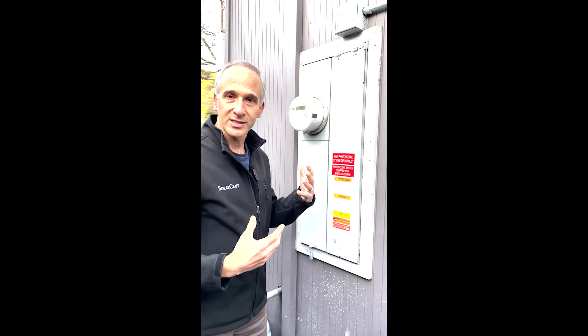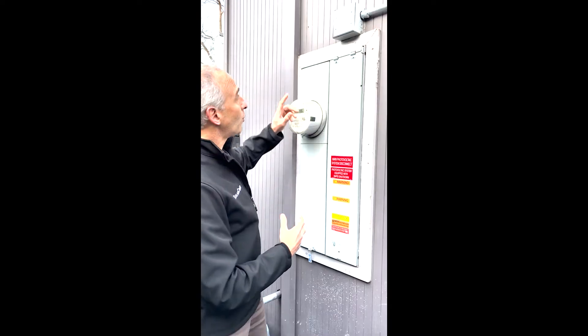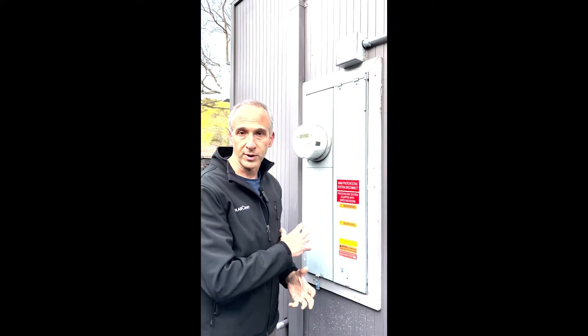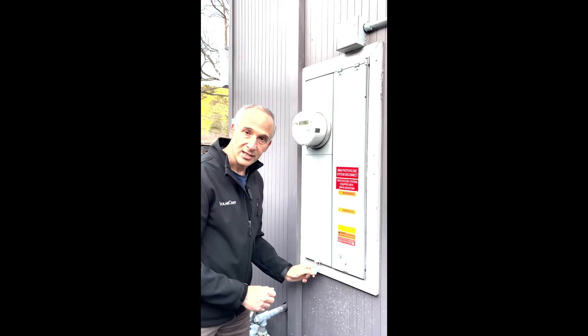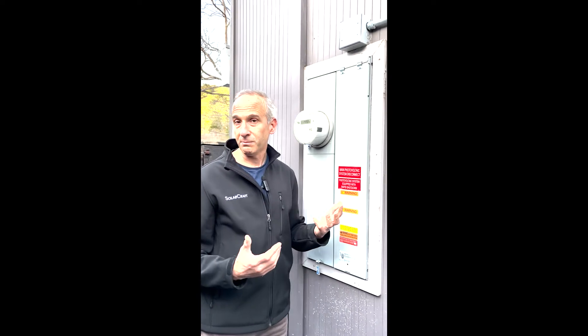Typically, this consists of your PG&E meter here. On the left side of the panel is PG&E's territory — electricians and contractors are not supposed to go into that side. The wires are fed either from up above from the PG&E lines into the panel, or from below. In this case they're from up above. There is usually a little tag that says this is PG&E's, same with the meter — there's a little tag here that should not be cut off by anyone but PG&E.